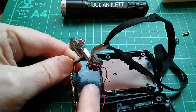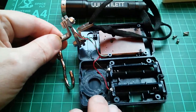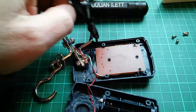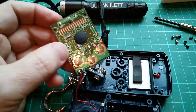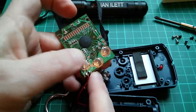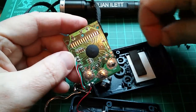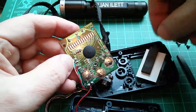It's a four-wire which runs up into the PCB. I might take that out because I'm not too concerned if this doesn't actually go together again. Now these battery terminals which didn't look like they were pushed in far enough — I thought they were going into the PCB but they don't, so I could probably just shove those in with a screwdriver to fix that. Let's have a look under this PCB. I mean it's not going to be anything mind-blowing — just an LCD and some buttons probably. So here's the circuit board: three buttons, just clicky buttons which are sellotaped on there. It's a pretty crude chip embedded in a blob of black gunk, and then just some connectors here which go onto the zebra strip. Here's the zebra strip — and here's the LCD which is just loose and fits in that bit of plastic, and that's it.